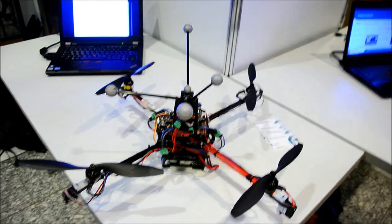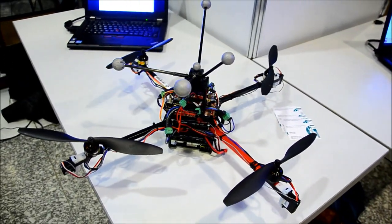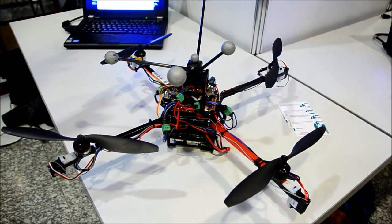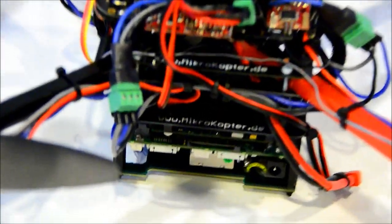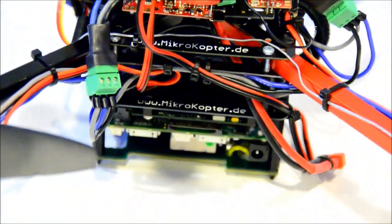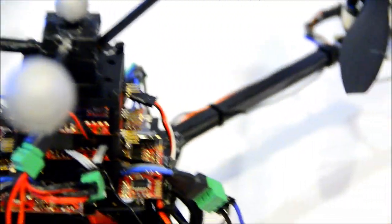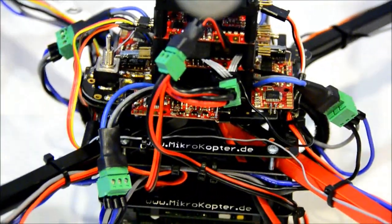a quadrotor without? So an easy use case, let's say the short-term plan, is really to fly into an environment that you would like to scan, but you don't have a pan-tilt unit on your quadrotor. With this kind of concept, you can directly reorient the quadrotor and scan the environment without the necessity of a pan-tilt unit.